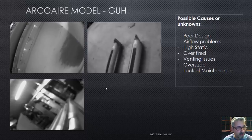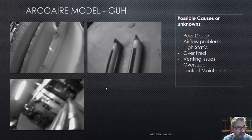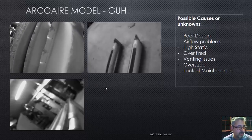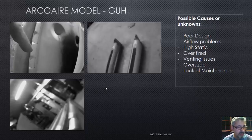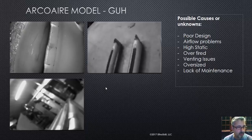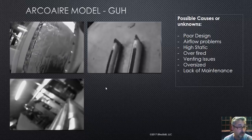As I go in between these cells, there's the hem — that's the crimped hem, and that's how they connect the two clamshells together. Make sure you check that. I have seen those fracture wherever they have that little crimp end — they're very difficult to see. You can see how I cut the back of the furnace cell with a sawzall, so obviously you can see it now, but it's not easy.